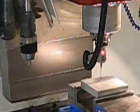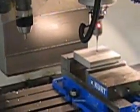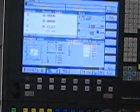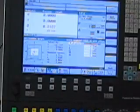At this point, the machine is going to move to the actual center of the part and allow me to activate the coordinate I just set. I hit OK. If you look up at the screen, the display is now zero, zero — I'm at the dead center of my part. My zero is now set up for my piece.